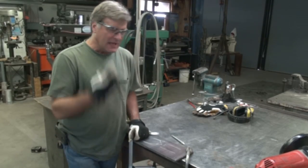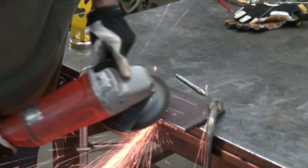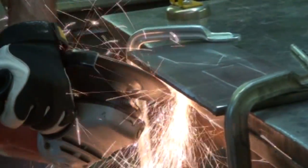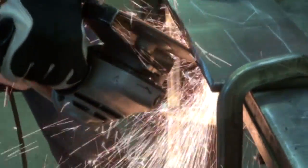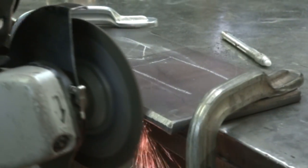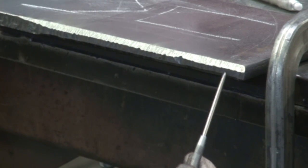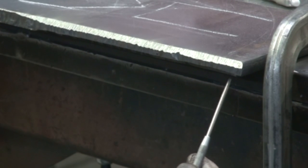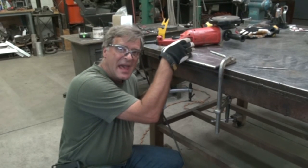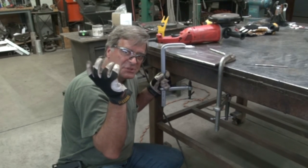You're going to show us? Well, I've got glasses on. Why not? Out of a half-inch plate, come down about a third, leave about a third, and grind off the other third. Once I finish this off and cut this plate in half, bring it over here, set it up there, clamp it down, weld it, weld it — done.